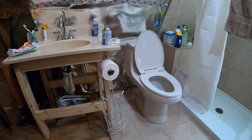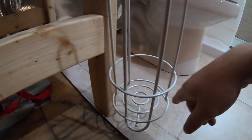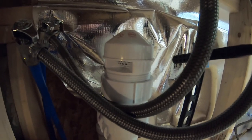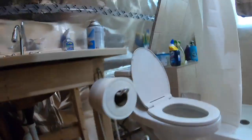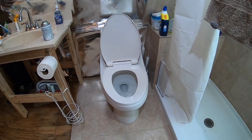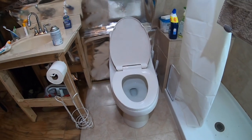Let's talk about toilet ventilation. This is four inch pipe under here that goes down to two inch and comes up through here, which is reduced to inch and a half. But here is this Oatey vent right here. When I put this together I thought it would be close enough to the toilet to vent, but when you hit the toilet it won't vent — there's not enough air. You might think your toilet's clogged or the flusher's bad.